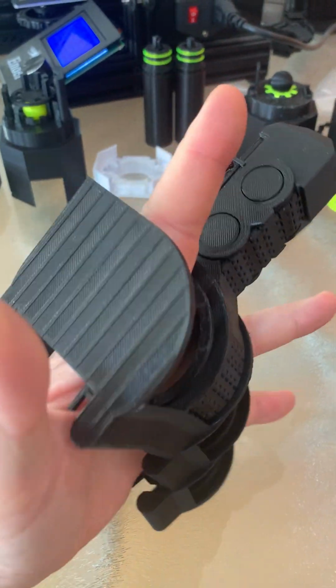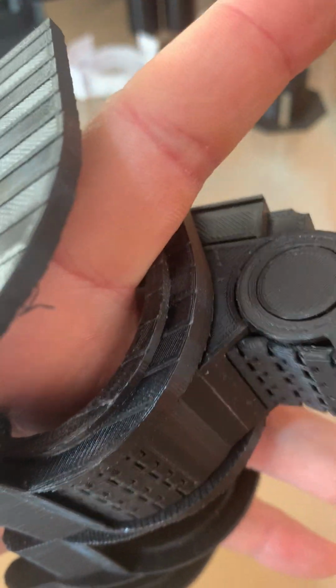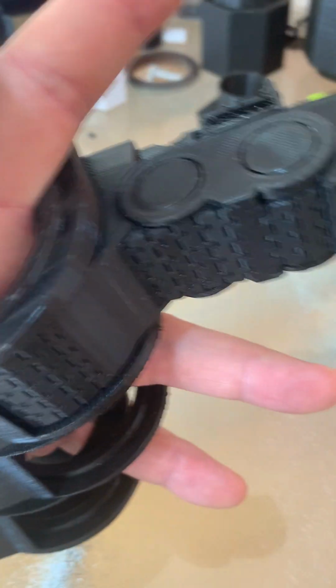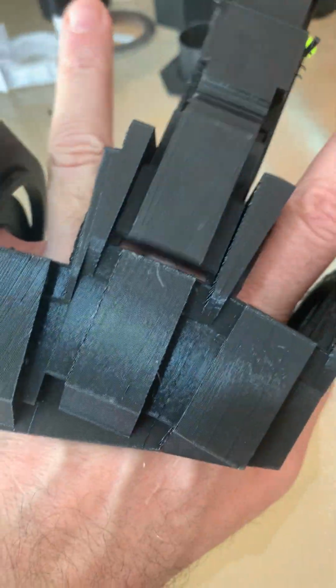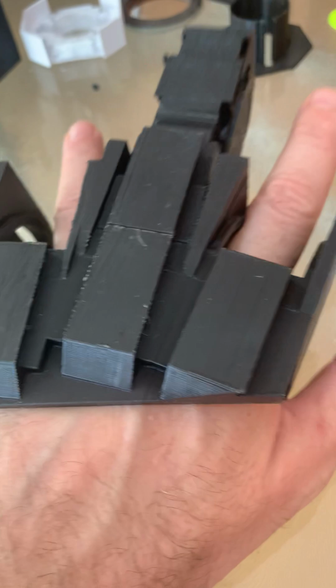So reducing the diameter is a good example. It'll also alleviate this congestion between this first joint. I need to find a way to point, but between this first joint over here and here, that space is getting tight and it causes additional knock-on problems. And obviously if I increase the angles, my knuckles are going to hit together, and this whole idea of having these sliding mechanisms to close up this gap is going to start to become difficult.